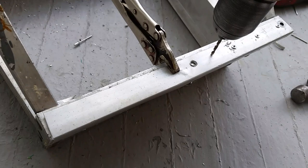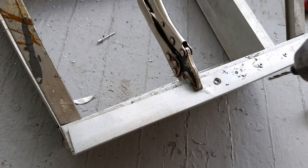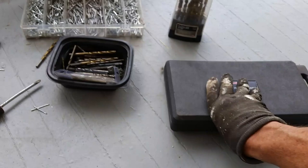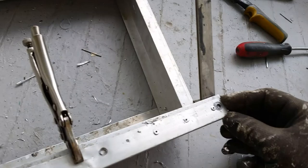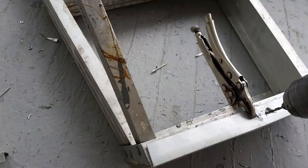Let's get a couple more holes in here, do this one-handed hopefully. The key is to go real slow with the bit - don't just jam it in there, you'll break your bit and you'll be upset. I got a couple big holes here I'm not gonna worry about now. Some of these bigger rivets would probably fit this little rivet down here. I kind of got to watch because this piece here moves a little bit, so I don't want rivets sticking in behind here. That's slid in there just fine. I'd like to have a couple big rivets here but these should hold just fine.